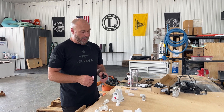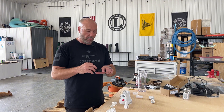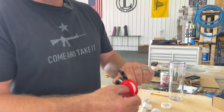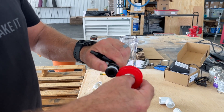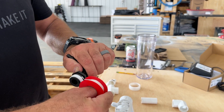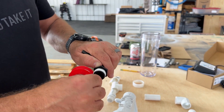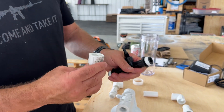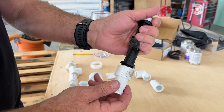Now it's time to put them together. For the threaded pieces you will take Teflon tape and start wrapping this around the threads. You want to wrap in the direction of the way you would tighten it — righty tighty, lefty loosey. I hold this with the right hand, put my thumb on it, and then wrap it around. You'll want this to be tight but not too tight, so give it several wraps around in the direction that you screw this together so you don't undo your tape. Simply tear it at the end, smooth it down, clean up the other piece, give it a quick air blast, and then thread it together.